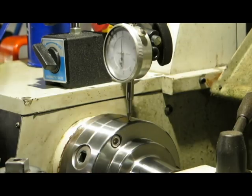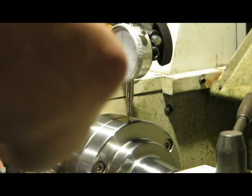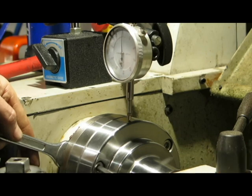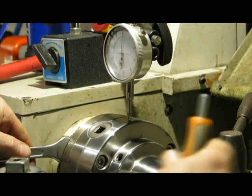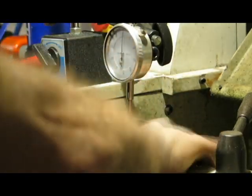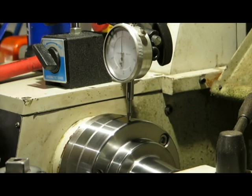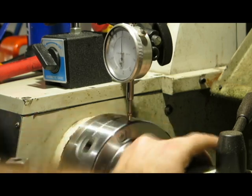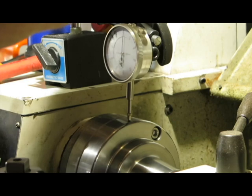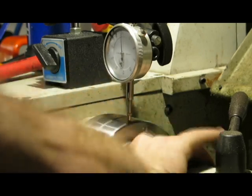and I'm just going to use a soft hammer, because we're so close already. I'm just going to snug these up a little bit so that any movement I make with the hammer is not too exaggerated. There we go. Right, so now I'm just going to turn this, and we really have almost nothing in that. So I'm just going to re-zero it. And it's probably 1/100th.